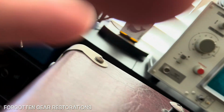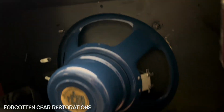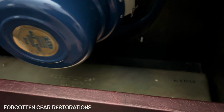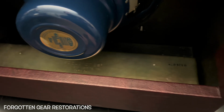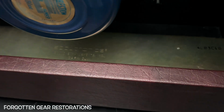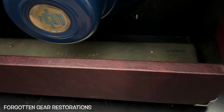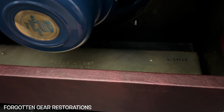All right, take a look here. Beautiful Celestion. Great taste, buddy. Your reverb pan, in normal cases with a very small cabinet like this, and that's as much pan as you're going to get in there, would be encased within a Tolex bag or a pouch, and that would be of use in helping to insulate it from the vibrations of the cab causing issues. And the issues that you're experiencing now would be among them.